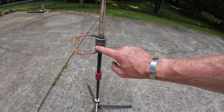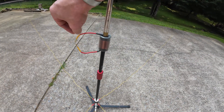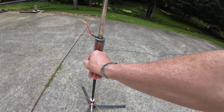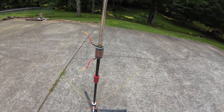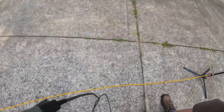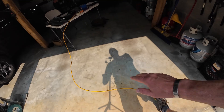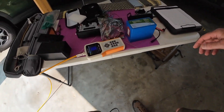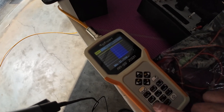Right now what's happening is I'm jumping around — bypassing — the 40 meter coil. I'm going to undo my jumper and move the connectors away from each other so they don't couple. All I'm doing is unplugging that jumper. Now let's follow the coax all the way back. Back to our graph at 7.050.